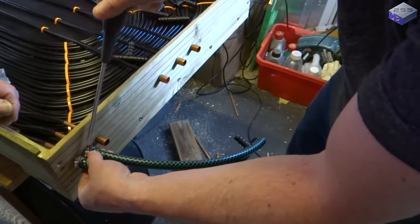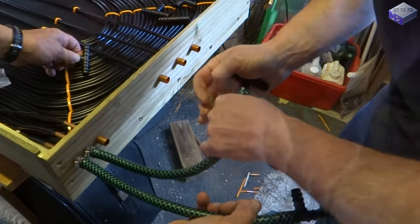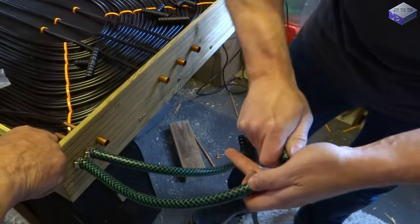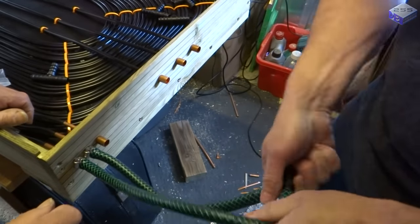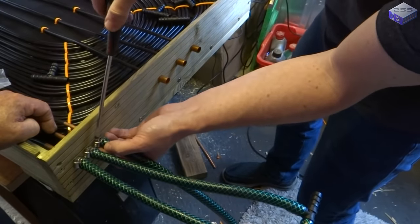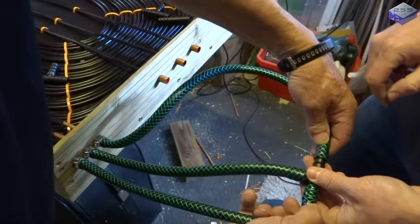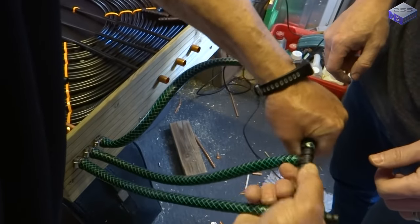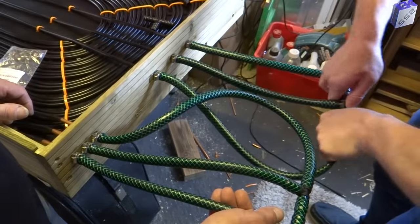The other benefit to doing this is that you can configure the pipes in any way, so you can have all three in parallel with the water flowing through very quickly, or you can configure it so that you've got it in series, so you can feed one into another pipe and then through all the pipes in series until it comes out the end pipe. But my guess is initially it'll be better to put it all in parallel, so to increase the flow and get all that heat energy transferred from the panel straight to the pool.